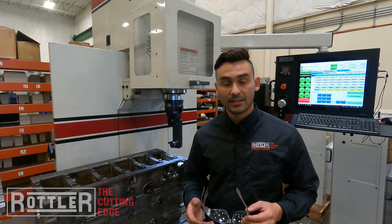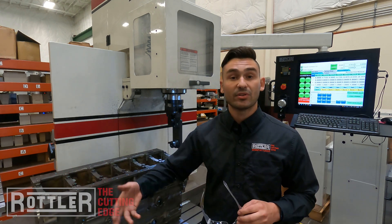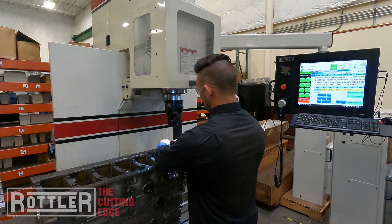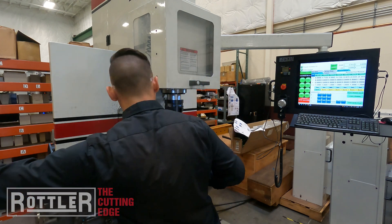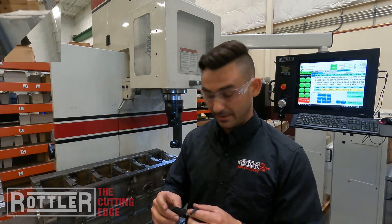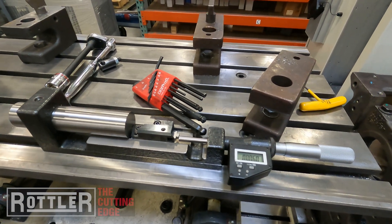As long as I've seen that first hole run correctly, I can take my cutter back out. If I had just done a witness mark in there, I'd measure it one more time and adjust it to go to my finish diameter — or just under if I want to leave a little bit on and sneak up on it. We'll just turn this back around with a 7/32 Allen key. I'm going to hop over to my boring micrometer and set this. I'm in incremental right now, going 6 thou above. If you were setting off absolute that's just as fine too.